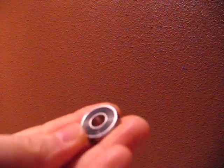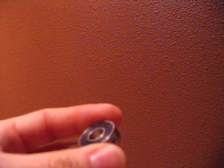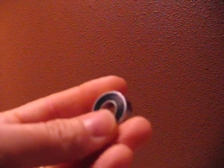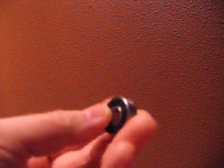Now these are 440 stainless inner and outer races. Again, non-contact rubber seals. But they indicated to me that these are the best 608 bearings that they have, which is the industry number size. It is used in skateboards. You're going to find them called skateboard bearings or inline skates. And they also happen to be the bearings for a number of components on 440 MM-1000 era Ampex machines, and a lot of other machines. You find a lot of Tascam machines that use these 608s.